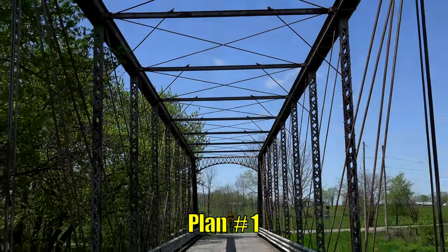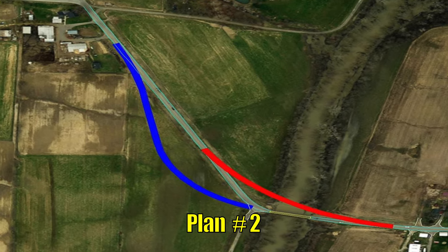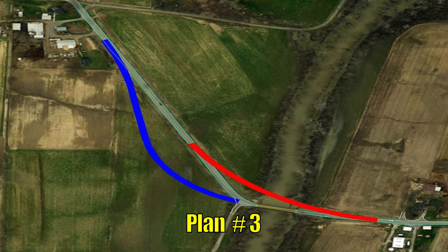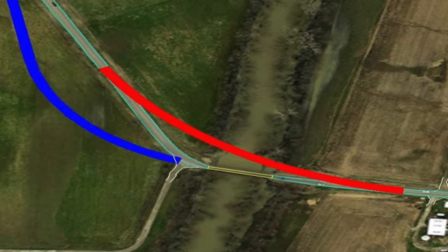What's the future of this bridge looking like? We put together alternative plans presented to the public: one was to rehab the original bridge and maintain it; the second was to rehab the structure and add a 35-mile-an-hour curve at the end to ease navigation; and the final alternative was to bypass the structure with a new wide two-lane road bridge with a 55-mile-an-hour curve to accommodate modern traffic as well as the local Amish community. We are proceeding with a replacement two-lane structure, with 80% federal funding, scheduled for construction in 2020.